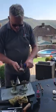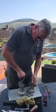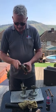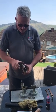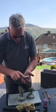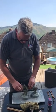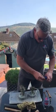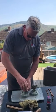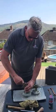Make sure it's well and truly cleaned off, then get yourself some good quality water pump grease. Blakes do a very nice quality water pump grease for their valves which you can still buy from them. Put that in there and off we go. One last very important thing: make sure this handle is faced ideally in line with the valve body, because when you drop it down in there you know that's open. When you look at the top of the collar — give it a little clean with a brass brush, not a metal one — you'll see an 'open' and an 'off'. Put the collar down accordingly, put a bit of grease on the nuts and bolts, don't forget the bottom shoulders are threaded, wind those down, and it's important to nip this down evenly. When it's off, it will be over where it says 'off'; when it's open, it's open.